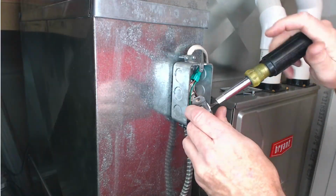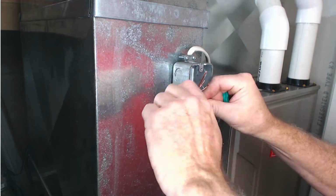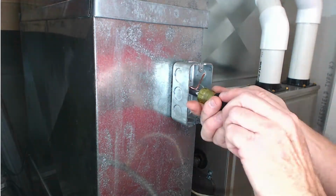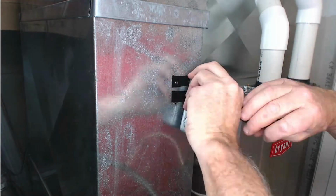You will need to pull the existing wires from the existing kill switch box and remove the old box. You can mount the new 4-inch by 4-inch gang box in the same area using your cordless drill and the self-tapping screws. Once you have the previous wires in place in the new gang box, you can continue the wiring as shown in the instructions.